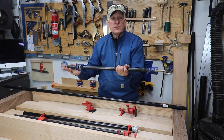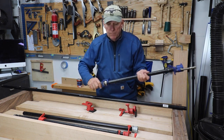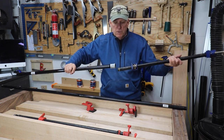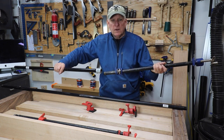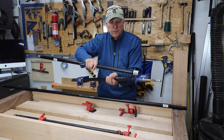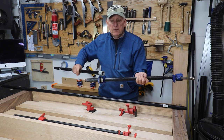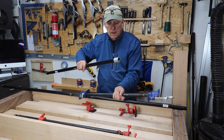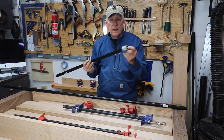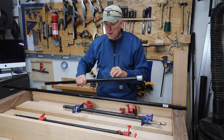If I want 30 inches I can have a 30-inch pipe, but if I need six feet I can just add another component — take this off, screw this onto the threads there, and I've got a pipe that size. So if I get maybe four to six pairs of these at about seventeen to eighteen dollars each for a pair, and then a variety of pipe sizes with the connecting piece, I can construct clamps of various sizes.